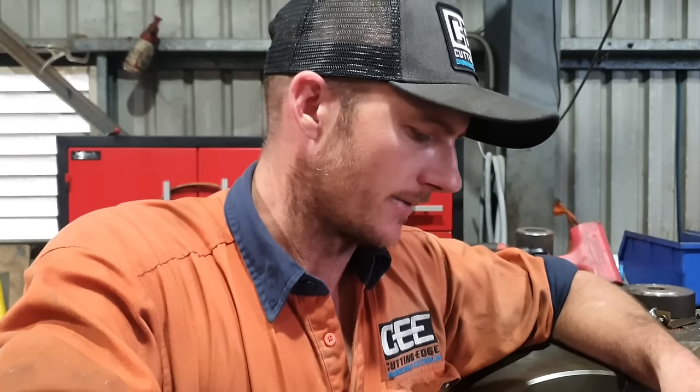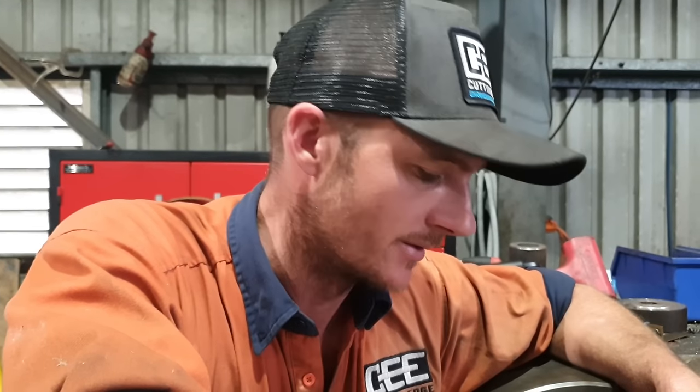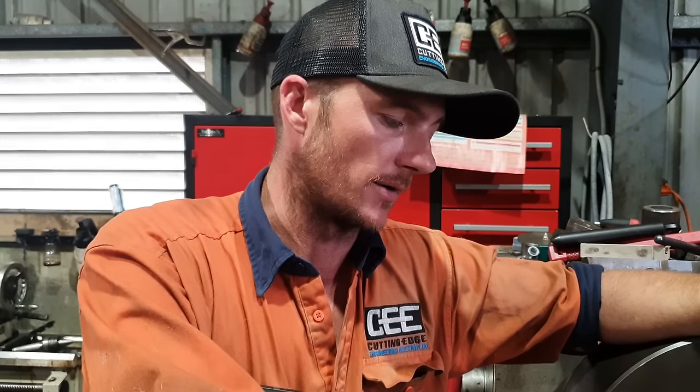So that cut then, that was a 6mm depth of cut, so 12mm overall, 335 RPM at a 0.25 feed rate. It has exceeded what I was game to do with my standard tool post. Very happy. Another good test is going to be when I start using my button inserts. The sheer size of them and the cutting surface is so much larger. If the tool post is going to give me any sort of grief, it'll be when I'm using a button insert. I haven't got my new 32mm holder for that yet. So you'll just have to keep your eye out for the next video where I'm using it.